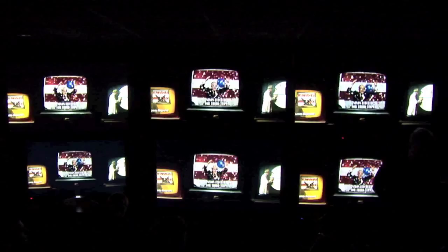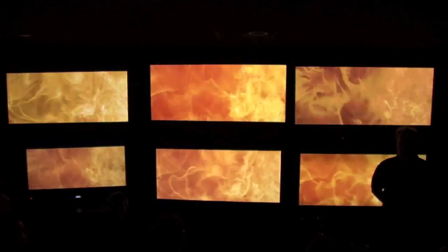You could also make an argument to go even above 5x5, 8x8, right? Exactly. If you start getting into 8x8, you still might be within the actual zone template of this particular display. But you're right, because not all displays have the same amount of zones. Regardless of the ANSI pattern, they're not always going to line up 100% with those zones so that you can get that astronomical contrast ratio. So the more squares, the better level playing field, because you will expose some of the zone issues. The data is still going to show you which one is higher than the other anyway.